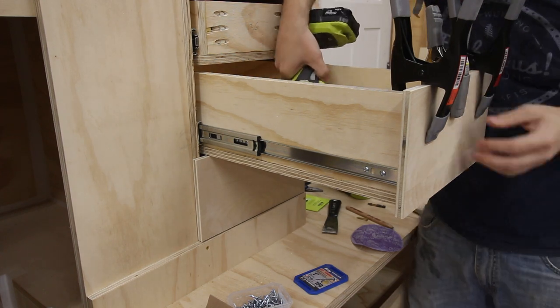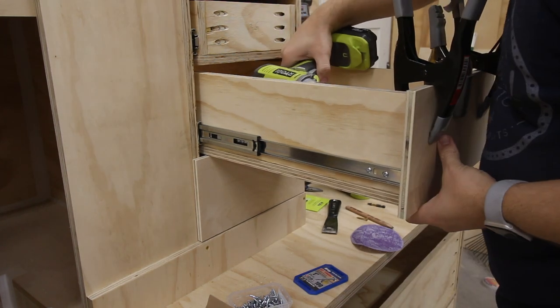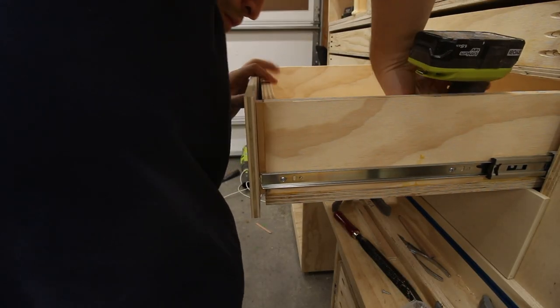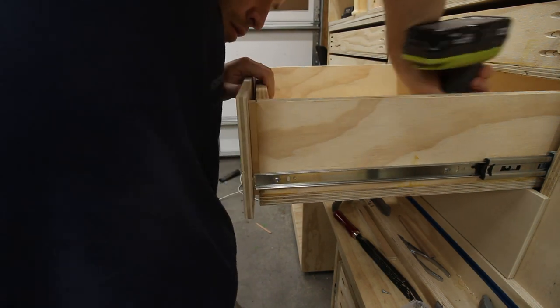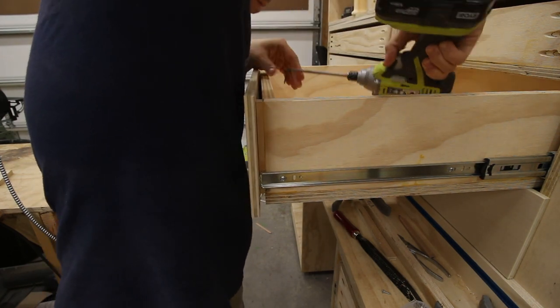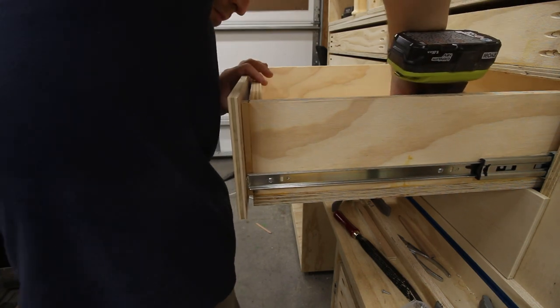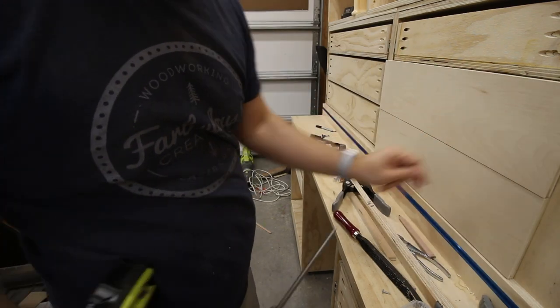With the drawer front clamped, I secured it in place with two or so screws from behind, using a few extra screws on the especially large drawers. This is where that hideous out of square glued-on fix came in — with that extra bit of support, the drawer front could be attached the same way as the other drawers, but I did have to use some longer screws on the side with a gap in order to reach the drawer front. I also inserted a few shims in the middle so that the drawer wasn't prone to bowing as I tightened the screws.